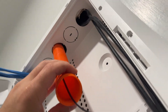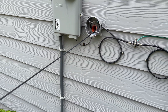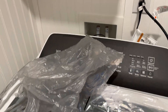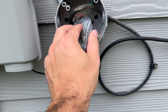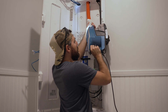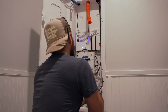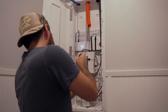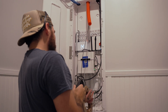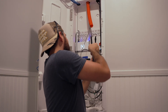While the paint was drying, it was a good time to run my fish tape through the orange conduit tube that feeds to the outside of the house. However, I quickly learned that 25 feet of reel wasn't enough. I then tried a trick where I tied a string to a bag and used a vacuum to pull the bag through the tube, but there must have been a kink because I couldn't get the bag sucked down the pipe. I went out and got a 65-foot reel, ran it through the orange tube, and began pulling my Ethernet cable through. I had an extremely difficult time pulling the cable through, but eventually, after tugging on the pipe long enough, it released. The tube must have been kinked or damaged somehow, making this way more difficult than it needed to be.